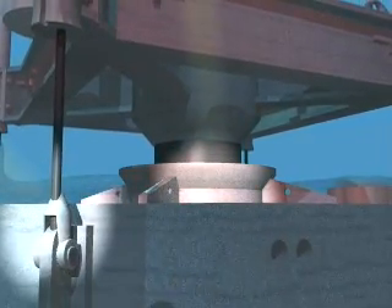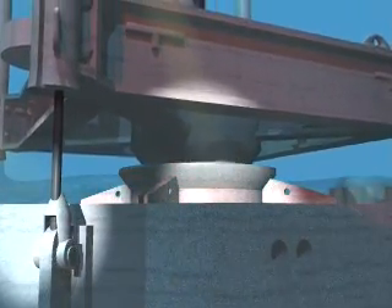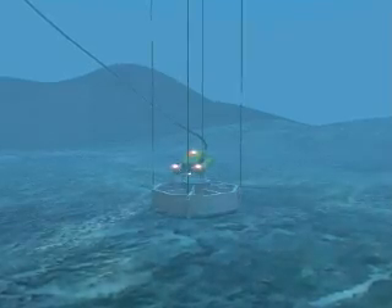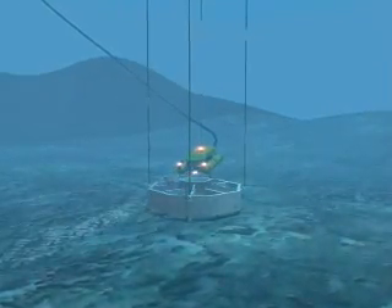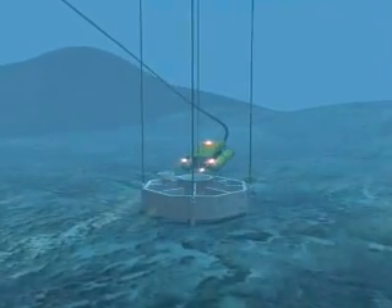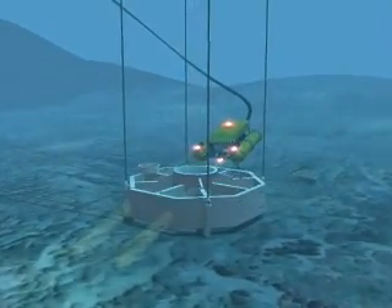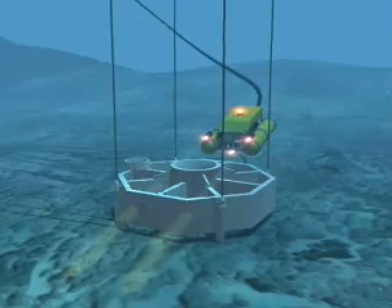In the event of contact between the PGB and TGB, the rounded gimbal compensates for a sloping seabed. The temporary guide base can alternatively be set on the seabed before installation of the structural casing begins, particularly if a hole is to be drilled first. The temporary guide base in that scenario may keep the initial drill bit from skidding on a firm seabed, and will make re-entering the wellbore with a structural casing much easier, particularly in areas with strong currents.